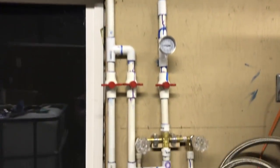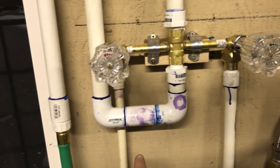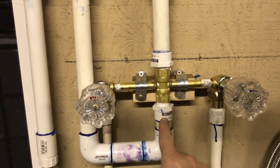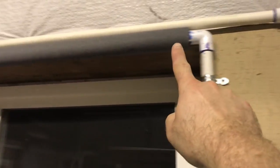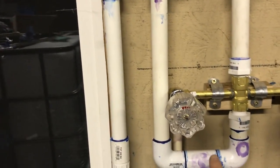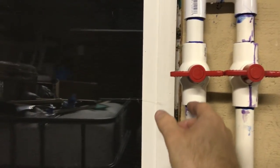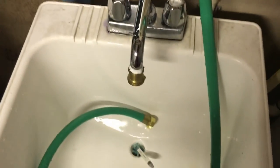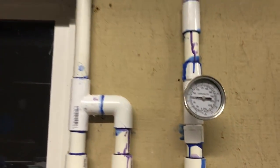Now we need to test it so we can know how many minutes to let it run. We are here at the sink where the water comes in — this is where all the original stuff was. I ended up re-piping some of this. Here's what I did with the shower valve: got our cold coming in and our hot coming in. I originally had a plug in here, but I decided to route this up and then it follows all the way over that big door. I put this here in case I ever want to do a big water change. I don't want water to sit in this line, so all I have to do is open this valve and any water there will drain back via siphon into the sink.